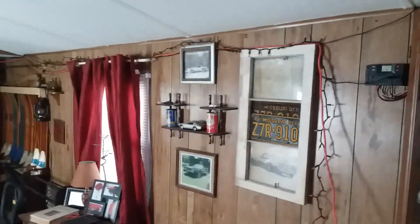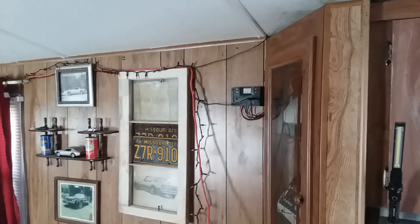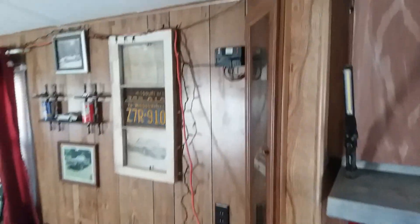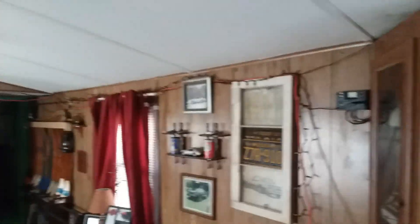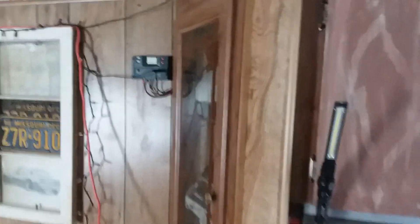I've tested and used a lot of different things off this and it seems to do really well. Of course, you've got to manage your batteries and make sure you've got enough power for nighttime so you don't have anything kicking off. I use 4-0 gauge wire — you can't see that in there, but I'd recommend 3-0 or 4-0 gauge. I had to get the biggest one, but it goes directly under the house and plugs into the inverter. Hope this helps you — thanks for watching.